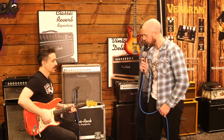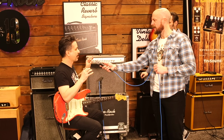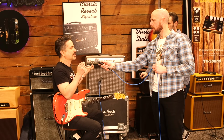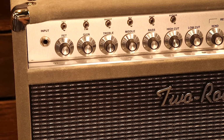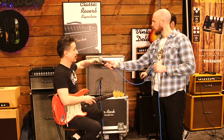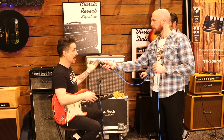Well, Corey, while I have you here, what's been your experience playing this amp in the combo format? The biggest, most robust clean sound of all time. But with all of the bells and whistles that you want. If you play a Twin or a Fender, the low end can be too frumpy, so he built this high cut and low cut into it that takes all the mud out of just the bottom two strings. And if you're playing a Strat or a Tele through it, you can really massage the high end in a way that's different than just a treble or presence control, which is really cool. Audiophiles know that you can do a lot with a high cut and a low cut, so to have that in the amplifier is pretty clutch.